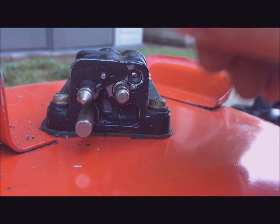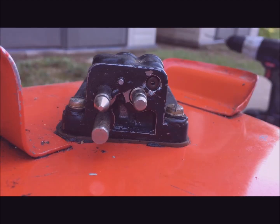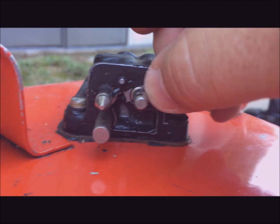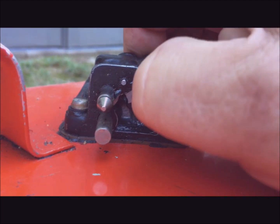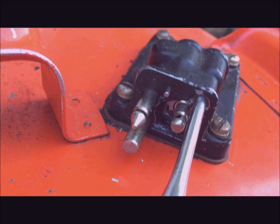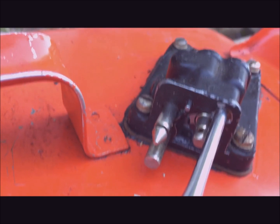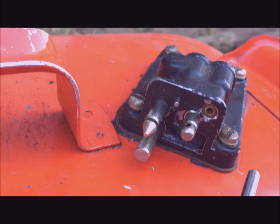Then I insert the O-ring back into the recess. Then I put the washer back in front of the O-ring. I need to tap it in so it's flush and then stake it. Here I am just pushing with a flat punch — it cleared all the staking and it's seated.